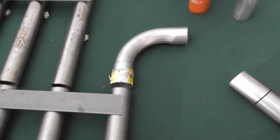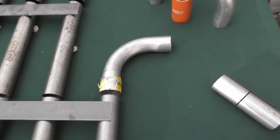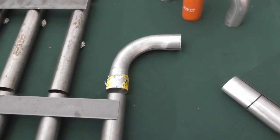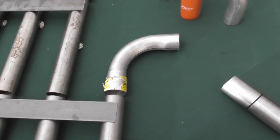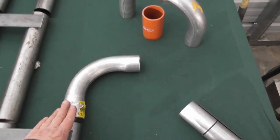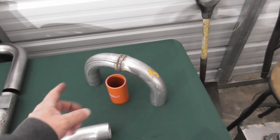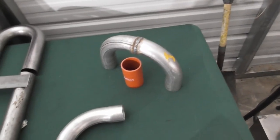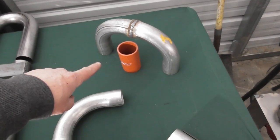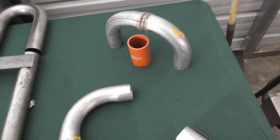Now in this configuration, it's going straight up and over the top, very similar to what the original version does. In the PDF drawings that I just showed you, we're changing that. When we go straight up, we have to add this other piece, which requires two more U-bends to go up over onto the heat exchange, and then they're connected via this high temperature silicone connector, which is rated for 500 degrees.